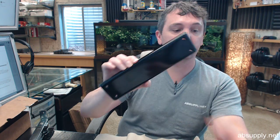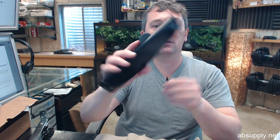So let's take a tour now that we know about the different types. Oh, and then the final thing, there's non-hold open and hold open. The 13 model is a non-hold open. If you want the hold open, there is no hold open in a heavy duty model. So there is no hold open if your door is up to 150 pounds. You can also do these. The trim plates are made of steel, except on two models, the 7821 and the 7822, that would feature brass base with a plating on it.